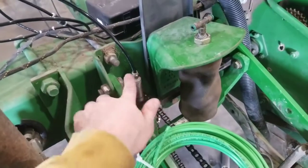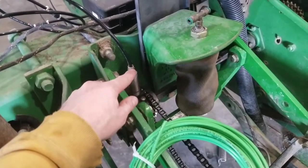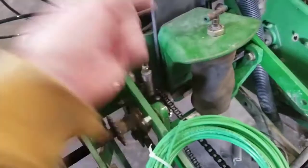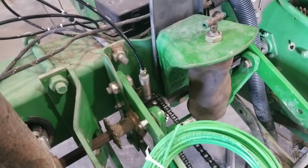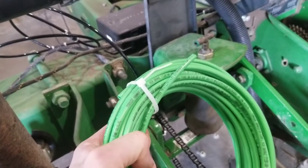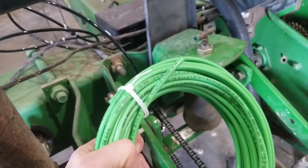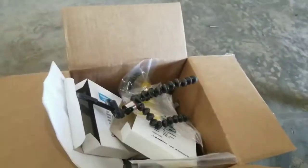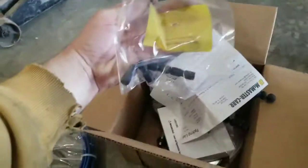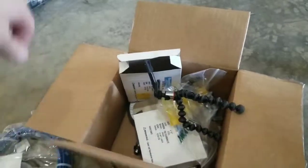True Count airline will work in these fittings, but this airline will not work in the True Counts because the ID of it doesn't allow it — you shove it in and it pulls right back out. Do not buy this from John Deere, do not buy this from Case, do not buy it from a machinery dealer. Find a truck supply place that sells it, or somewhere like McMaster-Carr. These airline fittings — you can buy them at a machinery dealership and if you're in a jam in the middle of season, that's where you need to buy them because they've got them on hand.